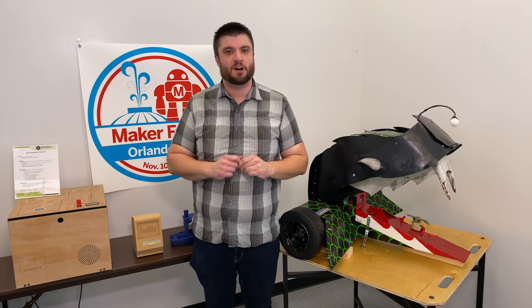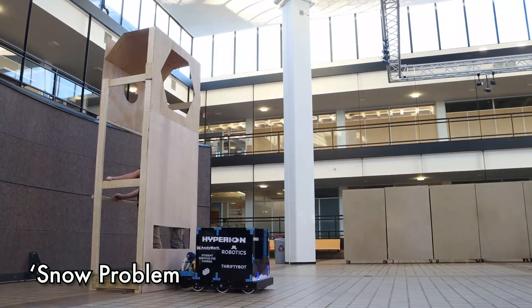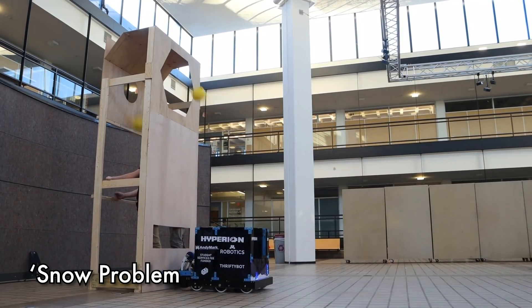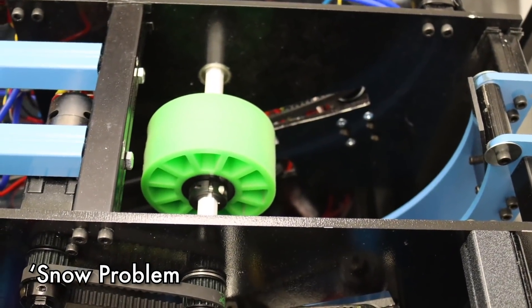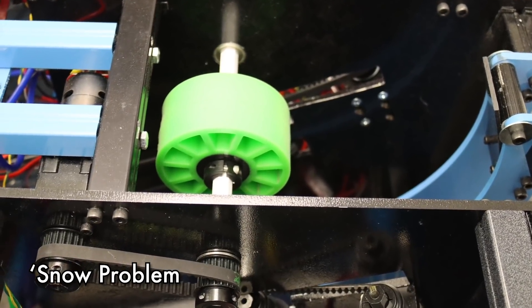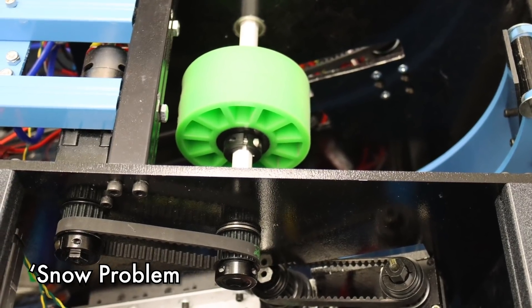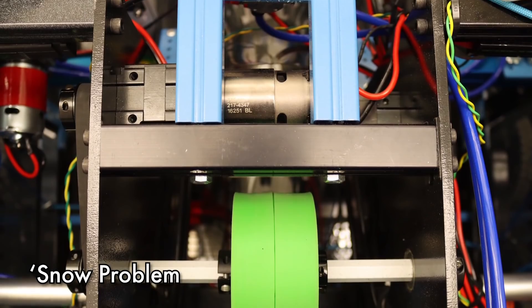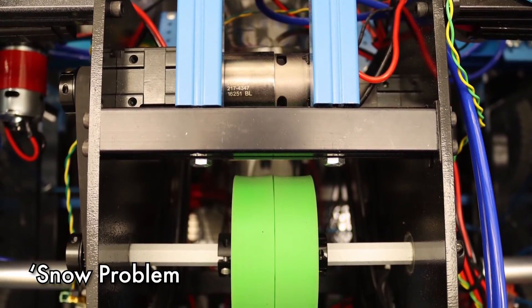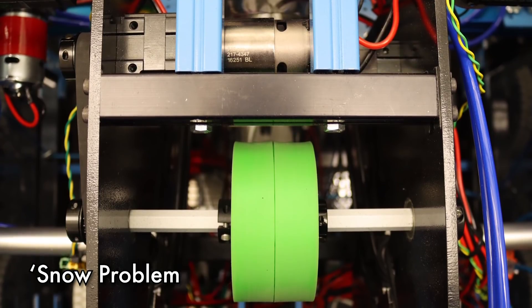Now that we've talked about indexing, Gabe's going to talk about actually shooting the balls. Snowproblem actually rams their robot against the wall of the field to line up their shots. This makes a lot of the guesswork very easy for drivers during gameplay and prevents other teams from interacting with them while they're trying to shoot into the outer port. Their robot has a single compliance wheel, which has a squishiness factor to add a little bit of compression with the power cell as it launches up and into the port.